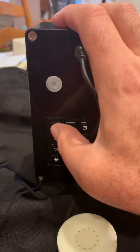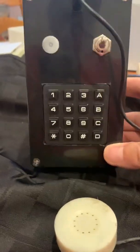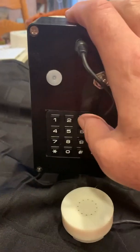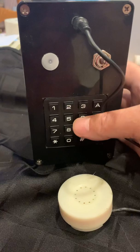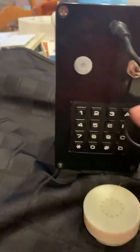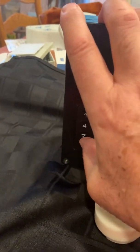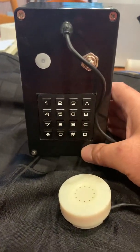Mode six is the red box mode. This plays the nickel, dime, and quarter tones that were made by a payphone when you inserted coins. You could dial a toll number, and when the automated system asks for coin deposits, you put in one real nickel but thereafter key in however much money you wanted. There's also a green box mode used to control payphones remotely, covered in the manual. The star, zero, and pound keys are the Canadian nickel, dime, and quarter tones — a single tone at the same timing as the US, but simpler.